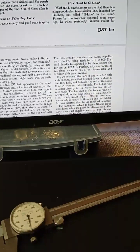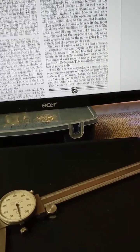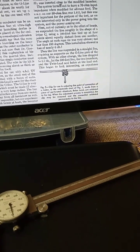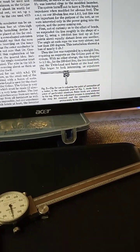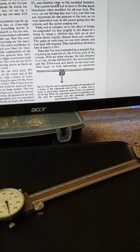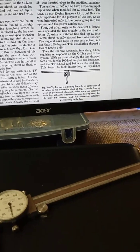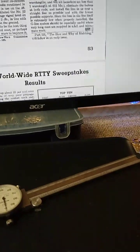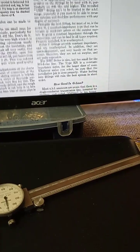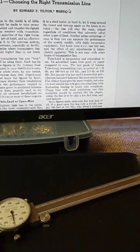Yeah, it's a transmission line against ground, but the author is apparently completely ignorant of that fact. So hams waste a lot of time ranting about ground, but don't understand anything about electromagnetics and why that ground is an absolute disaster at HF, because it takes RF and gobbles it up for lunch, turns it into heat. There's no magic. If you want a transmission line that works, it's got to be concentric, not this stupidity of open lead, which contradicts the first principle in this article, which is correct.